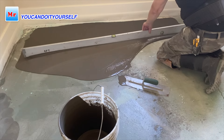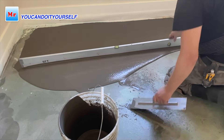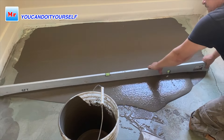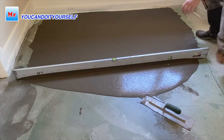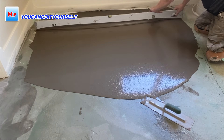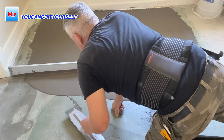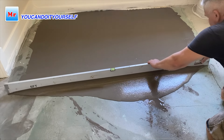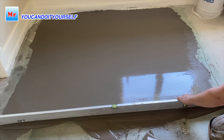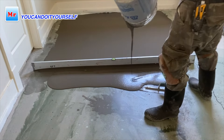When you're doing a flooring job you have to be an artist. Sometimes you do 100% level, sometimes flat, and sometimes you need to do a job like this one. I didn't know how hard it would be for this small room — I was guessing I'd just take the carpet off, grind some spots, fill some low areas, and start installation the next day. Usually a job like this takes two to three days maximum, but now it will be approximately four to five days. I used six bags of self-leveling compound total and I need to wait for it to fully dry.